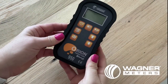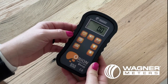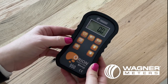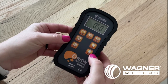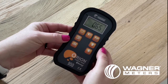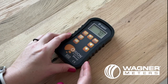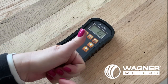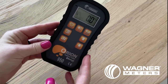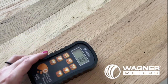So how do you measure moisture in wood? With a moisture meter. Wagner Meter's Orion 950 is a top of the line model that can not only figure out the EMC where you live, but it has a large sensor giving you more accurate readings every time. It can measure the moisture content in wood a quarter inch thick up to one and a half inches thick and is adjustable depending on the species of wood you're measuring. On average, ideal moisture levels are between 6 and 8%, but can vary depending on the EMC where you live. For more information, see the link in the description box below.